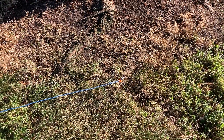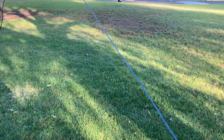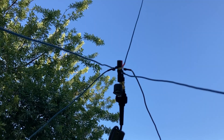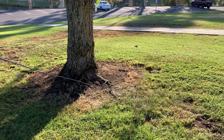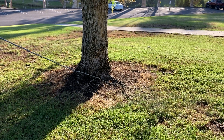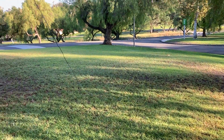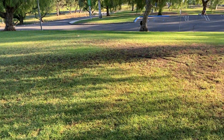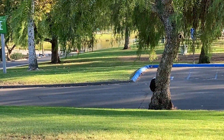One thing I want to mention: this is not a true quarter wave ground plane. The feedpoint actually needs to be a quarter wave high — about 16 feet — which would be another 10 feet higher, and the radials would need to be tied to a line up there. Maybe one day I can get the line 33 to 35 feet up in the air. But even so, getting these DX contacts is pretty interesting. I'm on a hill, elevated about 322 feet according to Gaia GPS.